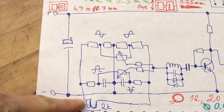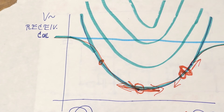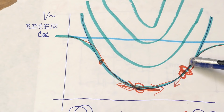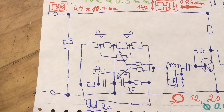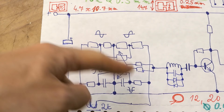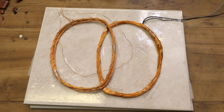This contraption can cancel out the waveform in the receiver coil quite nicely, and you may need more than one turn on the transformer — I now have two turns. But the question is whether it's actually good to cancel it out as much as possible. It seems it's not — it's better to leave some voltage on the coil and operate at a slope rather than at the minimum point. That raises another question: what phase shift should the remaining voltage have, and is the improvement worth building this complex circuit? Finding out would require a lot of experimentation, but first the coils need to go in resin because the vibration sensitivity makes experiments difficult. Further experimentation will be left for the next episode.